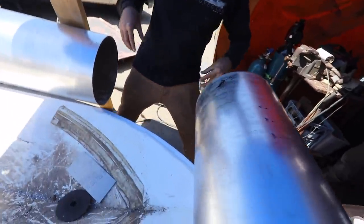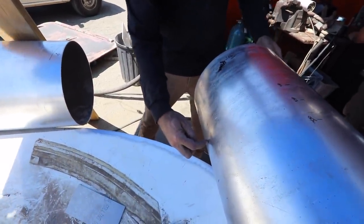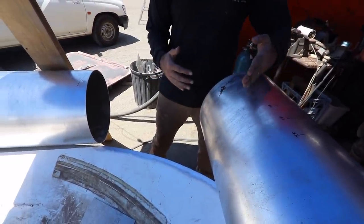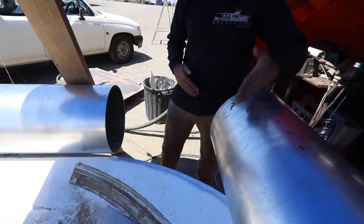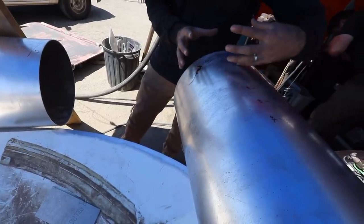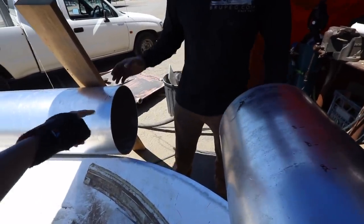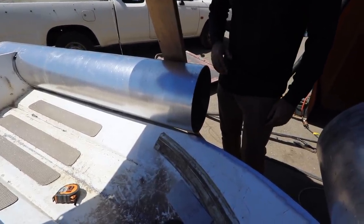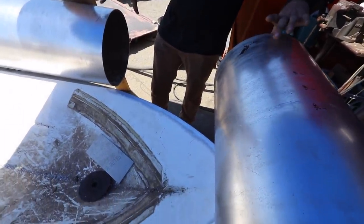You can see this tube has to go here. The inner edge will be there and the outer edge is out over here. So we have to cut an angle across like this that is halfway between the maximum. This angle here is 115 degrees, so we have to cut a 57.5 degree angle across there, and we have to do it on both tubes and then join them together to get one weld all the way around and that'll link up. And this one here, what angle are you doing on that one? This is 20 degrees, so we're doing a 10 degree cut across there. Then a 10 degree here and a 57 and a half here should theoretically allow one pipe to link these two up.